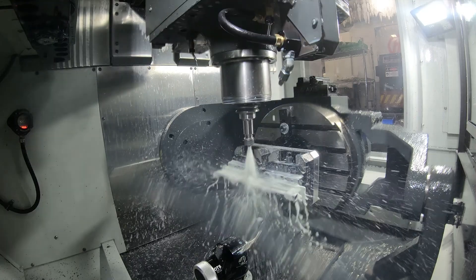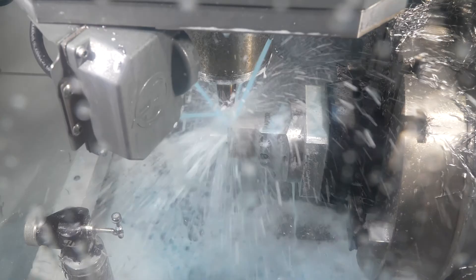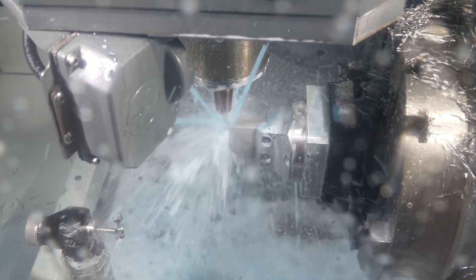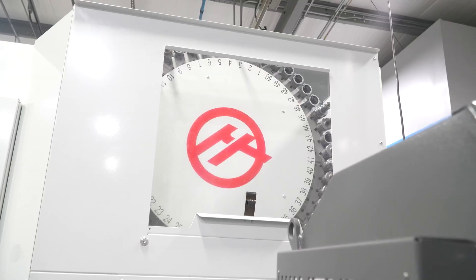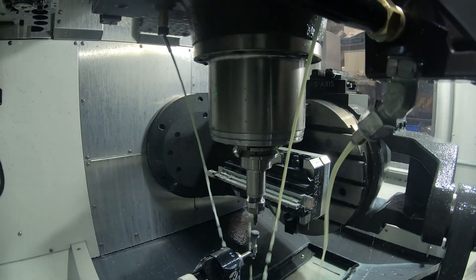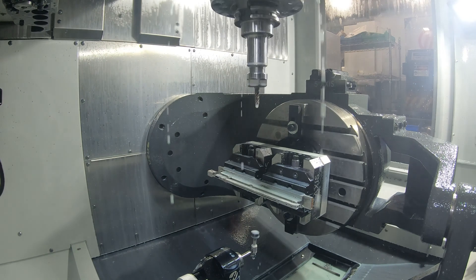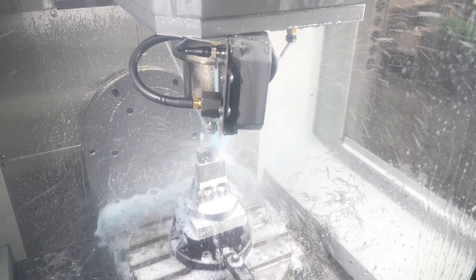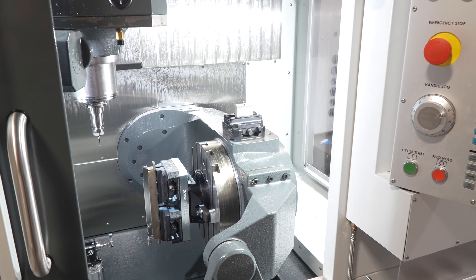When cutting stainless, using the high-speed machining really helps a lot by cutting down on cycle times and saving tool life. We have 50 tools, which has allowed us to use the tool life management to change to a new tool once the current tool has reached its tool life capacity and continue running without having to stop — it's already in the machine, ready to go on standby.